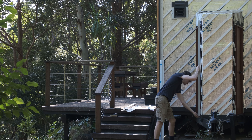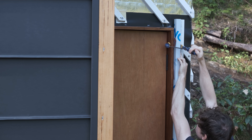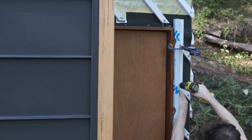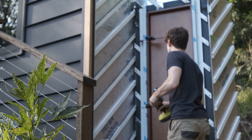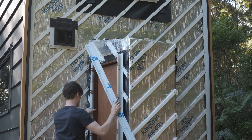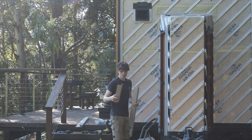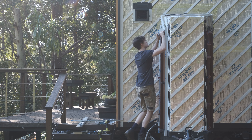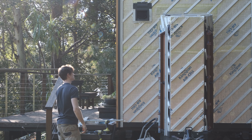I treated the flashings around the doors the same as the edges of the wall — I didn't want water sitting against the wood so I spaced them out with packers. I've made these door frames from spotted gum, which is a fairly durable species of timber, and I've coated them in marine varnish, but allowing them to stay dry by leaving a small air gap should make a big difference. When I ordered the flashings I failed to account for a gap at the top of the custom doors, but I rectified this using offcuts from the panels on the other walls. The profile for the bottom of the panel fits really well into the spot and covers what would otherwise be an open gap into the wall cavity.